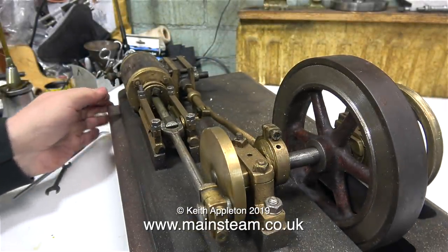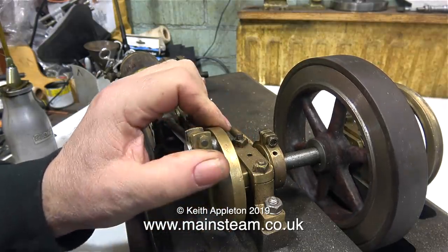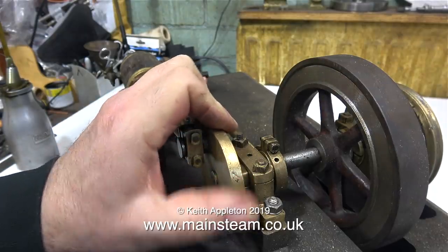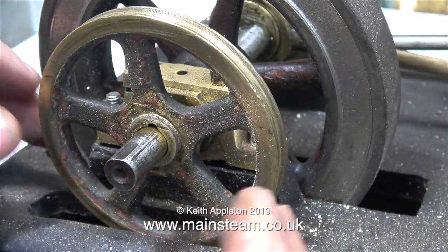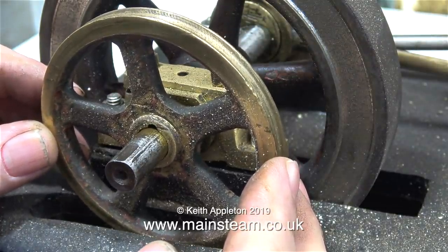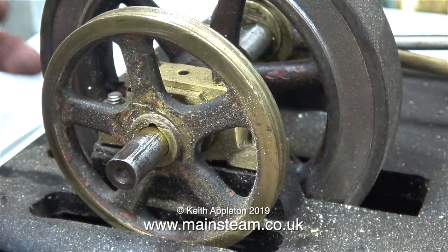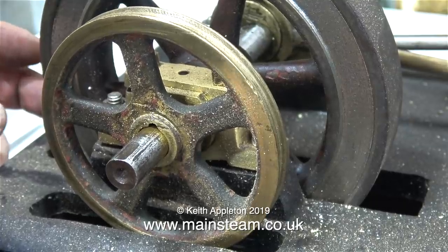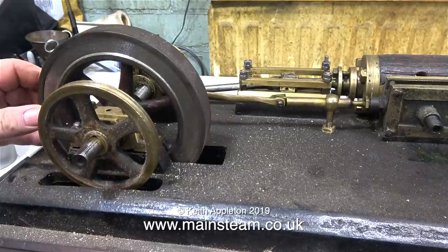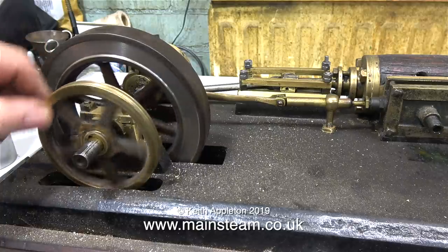Here's another engine, and this is also a bitzer engine. It's either antique or just an apprentice piece, but it looks like bits and pieces of an apprentice piece to me. The big ends are fixable and the main bearings are fixable, but what about the flywheel? This is not the original flywheel, and this is not the original pulley — they're just nowhere near the diameter of the crankshaft. The base isn't square; it rattles about on my bench. When I fed some compressed air into the engine, it never even tried to move — it just sat there. So this is fixable, but it would be expensive. And is it really worth it?